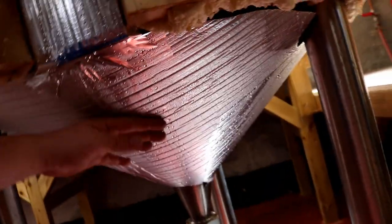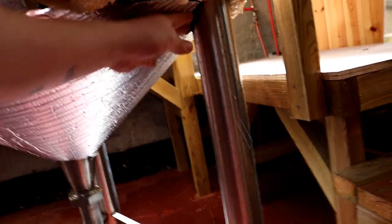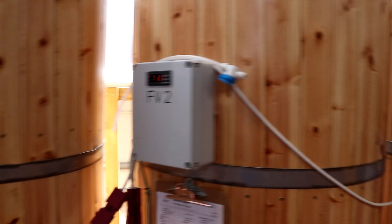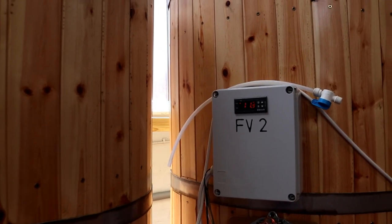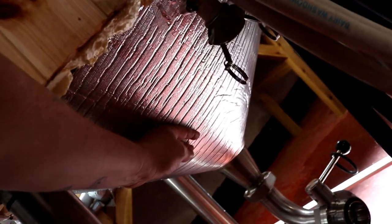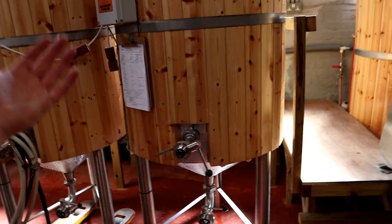The next job, which isn't essential right away, is to insulate the cones. We'll use a little bit more of this foam. As you can see it works really quite well, but we do have some condensation on the outside because it is so cold. That one's condensating on the outside because it's sat at 5.3°C. That one's not because it's sat at 11.9°C, and this one is also at 5.3°C. That foam insulation is definitely better than nothing at all.